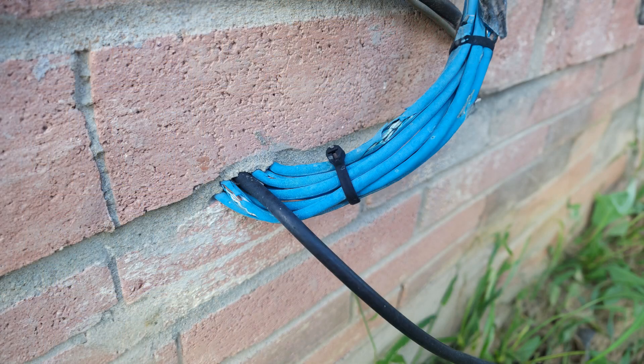The next big disaster I see here is that the cable goes down and then turns directly into the house. So what happens is when it rains, the water goes down and goes directly into the house. This needs a drip loop. What it should be is: it goes down, passes the entrance to the house, then turns around and comes back, and then into the house.